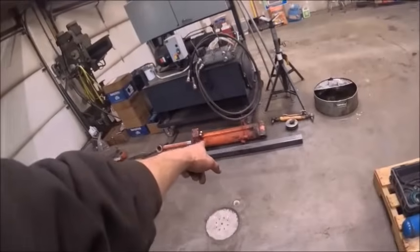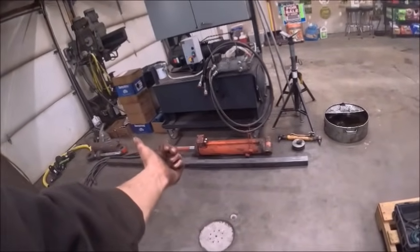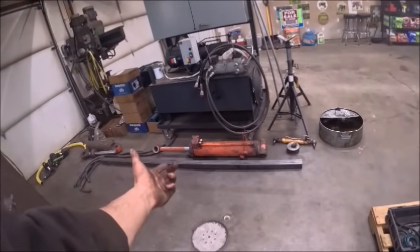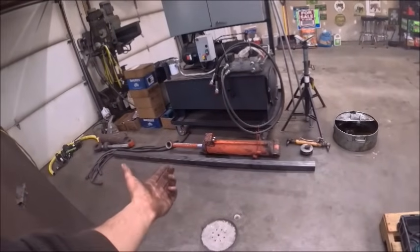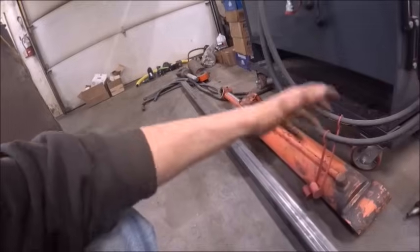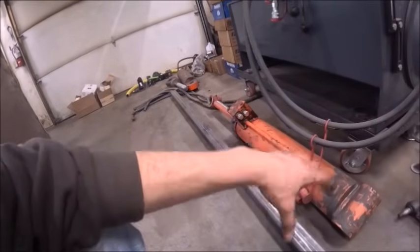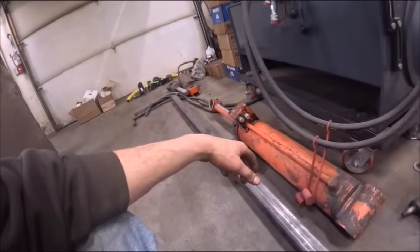And that's the box tube for the drawbar on the toolbar. I'm probably just going to go run in the morning and get some weld on chain hooks and some probably 5/16 grade 70 chain, and weld hooks on the tube and make some brackets to put hooks on the toolbar. Right off the bat I'll put chains and turnbuckles to take any side slop out of this thing and pull a little bit of tension on it, basically just to be safe.